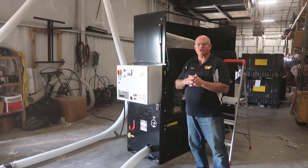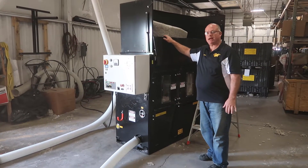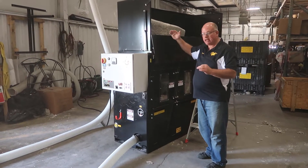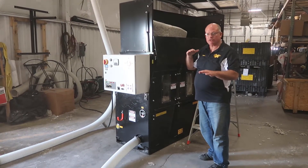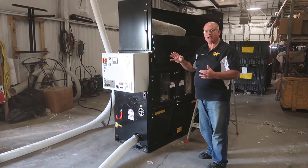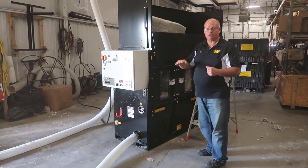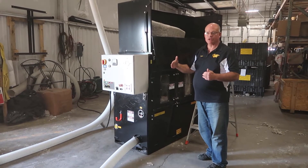We're going to go ahead and proceed with our test. Right now we have six 25-pound bags of Applegate insulation in here. There was previously a bag already in here, so when this empties out there will be a little bit of a bag left — we're actually doing a net of six total bags. There's about a five-second delay start on this machine, so when the blower turns on, after about four or five seconds the agitator starts feeding. That's the point where we'll start our timing interval after the delay.